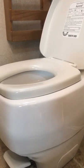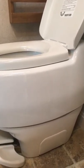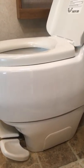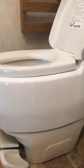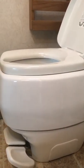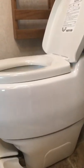Okay, it's a good unit. Unlike a residential style stool, there's a lot of piping in here. There's a fresh water supply, there are vent tubes, there's a rinse ring tube in there. So there's a lot of tubing. I replaced it all and the clamps, so there'd be no problems with this stool. It's like brand new, ready to rock and roll.